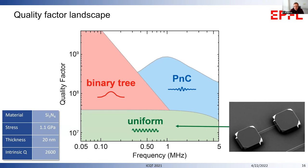Once this was understood, the goal became engineering away this boundary curvature. In the frequency range from 50 kHz to 5 MHz, a 3-millimeter-long uniform beam already has about four orders of magnitude of dissipation dilution from this geometric non-linearity, allowing Q values well exceeding 10 million at room temperature. I will explain how we can further enhance this effect by engineering beams with reduced curvature at the clamping points.